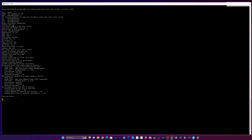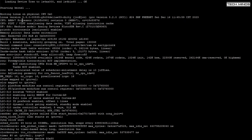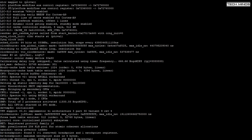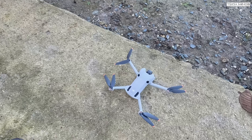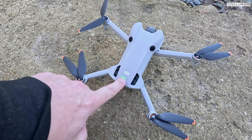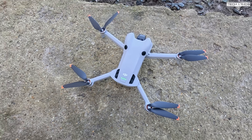Once connected, you'll see an output on the terminal window, and once DJI drone ID frames are detected and decoded they'll be shown on screen. So let's head outside and fly the drone. I have a DJI Mini 4 Pro, and I won't fly it too far away because I'm not sure how well the antenna I'm using will receive on 2.4 and 5.8 gigahertz.